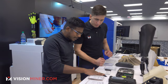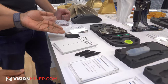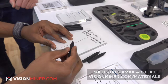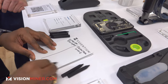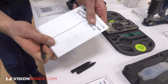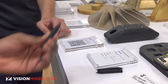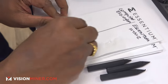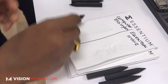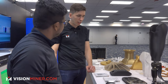We have a great example here showing carbon nanotubes coming off competitor materials. We printed some pencils — off our Z-line filament, the HTN-SN nylon, which is a Z material — and it doesn't write, falls off, no residue at all. With a competitor nylon, even with light pressure, it writes like a crayon. Go hard at it and it's literally dust. That's where our ESD materials find a lot of space in electronics manufacturing facilities.